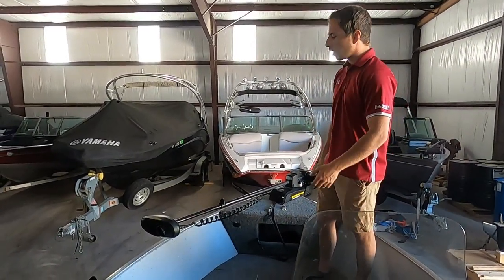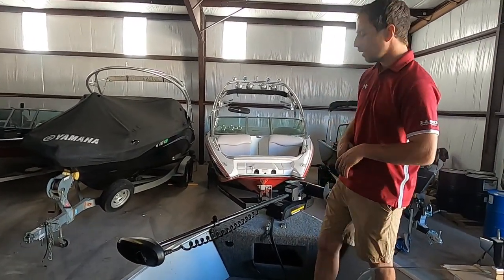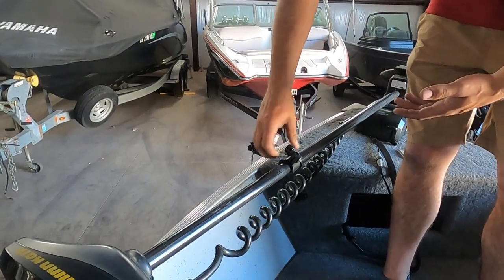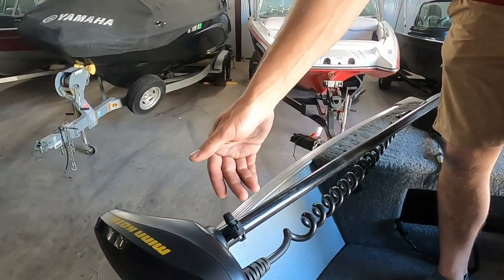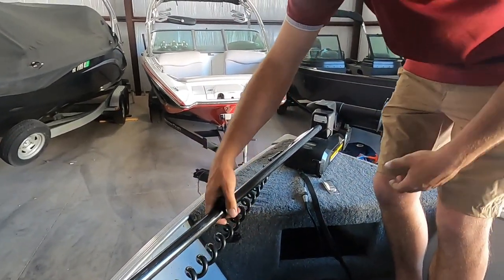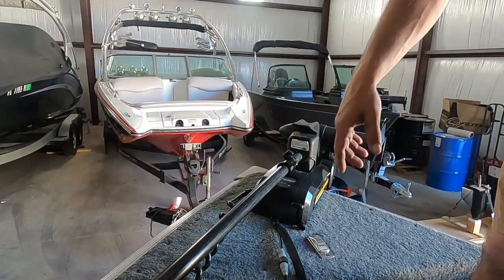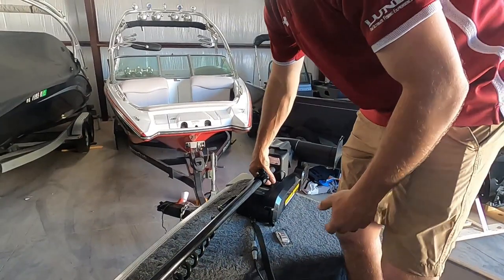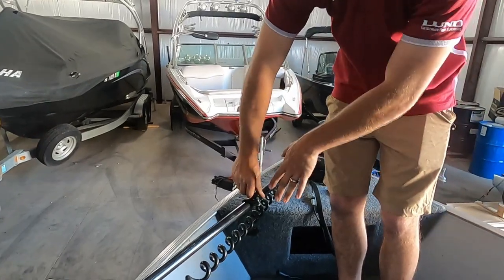Now on the inside of the boat, we're going to start at the bow and work our way back into the cockpit. First thing I want to go over is the Minn Kota trolling motor — this is a Minn Kota PowerDrive V2 12-volt system. First thing I want to talk about is the adjustment shank right here. By adjusting this, it's going to adjust how deep in the water the trolling motor is. There's really no reason to have it anywhere other than all the way up — that way it's the deepest in the water. The one exception is when you're driving down the road or driving down the lake not using the trolling motor — you want to have this all the way down at the bottom of the shaft so it can't accidentally deploy, especially going down the road. You don't want to have this pop off and drag down the road.